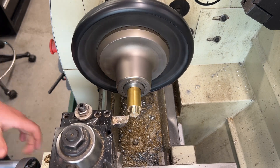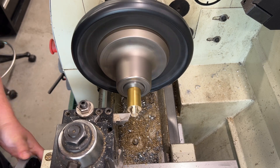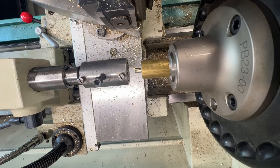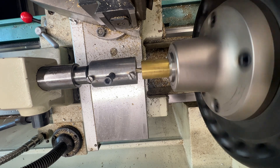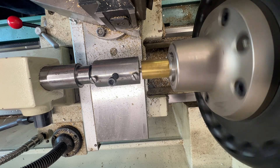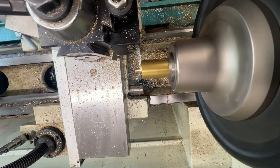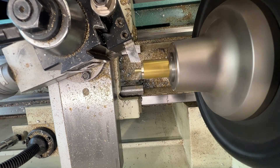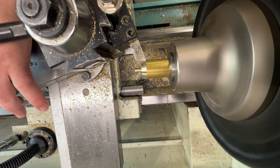First thing I'm going to do is load up some brass stock. I like to start out with getting a quarter-twenty thread on the back of these. It's significant enough to hold it in the wood and easy enough to just knock it out real quick. So put on the thread and then I'm going to put a little relief — my die can't get it down to the bottom, so give it a little relief so it can get nice and tight when I actually screw this together.